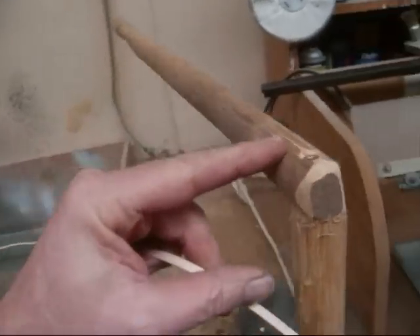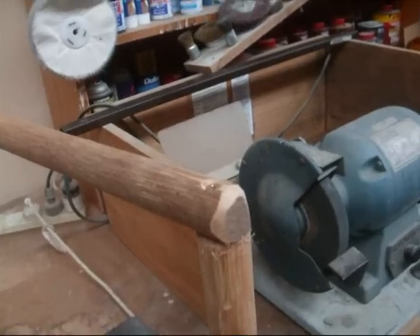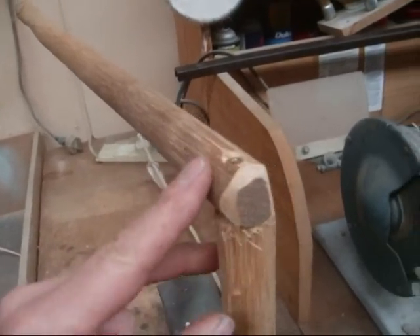I'm going to show you how to bind the corner of an arm. You can see this is a normal L-shaped piece - pretend this is the arm of a chair. Generally there's a whole bit of binding that sits all across that piece to hold it in place. Before you get started, make sure you soak the rattan peel in water for a few minutes, and get some PVA glue, because you're going to need that to make a nice tight join. You'll also need a staple gun or a couple of very small brads.